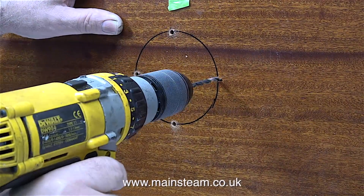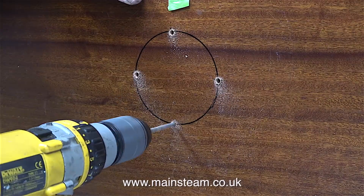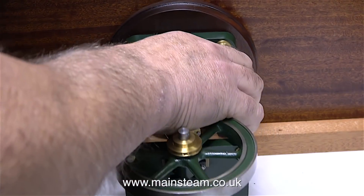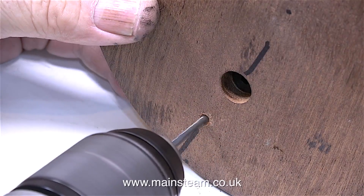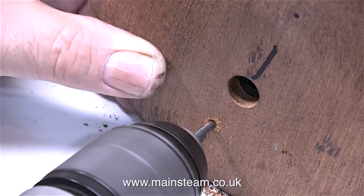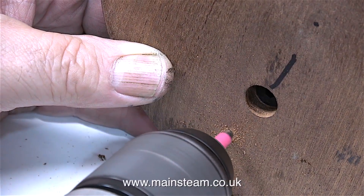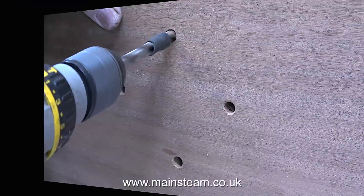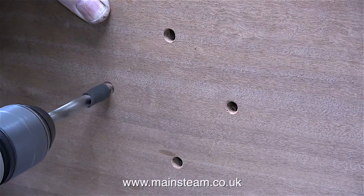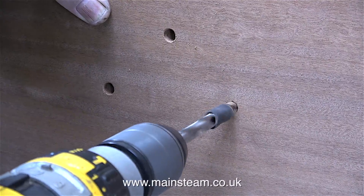I'll speed up this part of the video. I don't drill all the way through initially — I just drill part of the way through, then complete the process and go through the other side. To line up all the engines on the board I'm using a piece of mahogany just as a guide — this is not going to be fixed, it's just a template. I use the 3/16th inch drill to make a mark in the engine's baseboard, then drill a 1/8th of an inch diameter pilot hole. To prevent the twist drill accidentally going all the way through, I put a piece of silicone rubber fuel tubing on the drill bit itself as a depth stop. Similarly when counterboring the underside of the main baseboard with a larger diameter drill, I use exactly the same principle with a larger piece of tubing — counterboring is needed to take the length of the screws holding the engine in place.